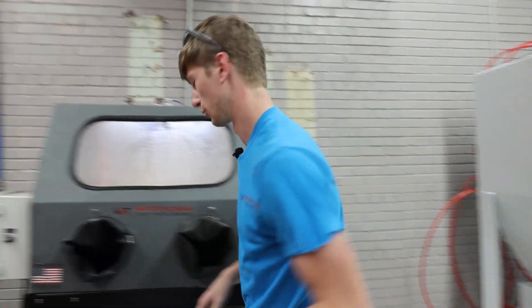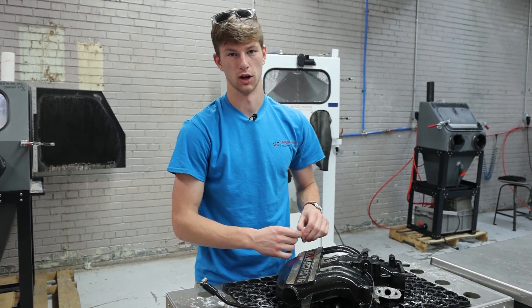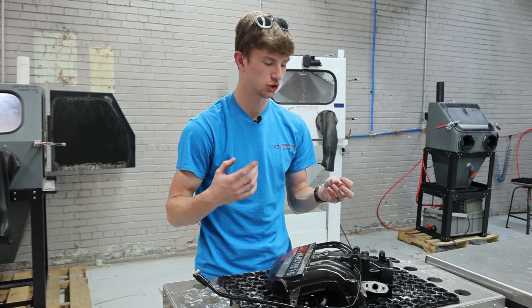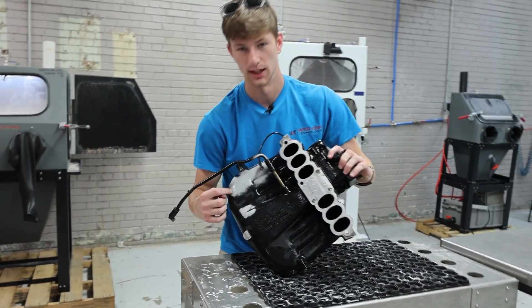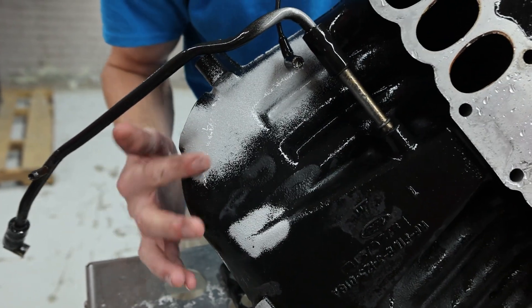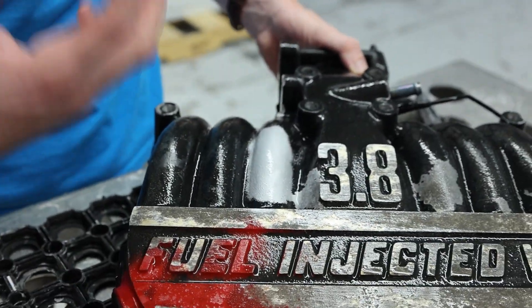This mixture is having a very hard time removing this paint, so I'm going to flip the part and find a spot where it takes off better so you can see the finish. We don't normally recommend this mixture for removing paint of this caliber. It did take a lot longer compared to the crushed glass, which was expected — you had to hold it in one spot, which isn't optimal for efficiency. But you can actually see a difference in brightness: the crushed glass side is darker, meaning a rougher finish, while the glass bead and aluminum oxide mixture side is noticeably brighter.